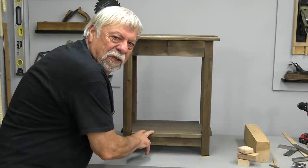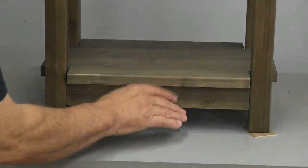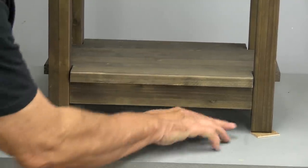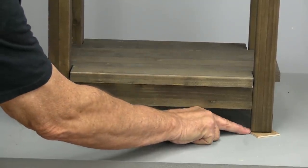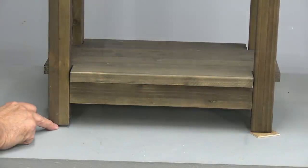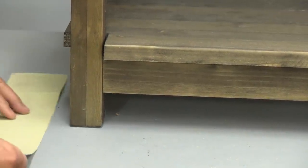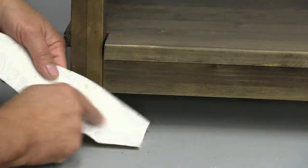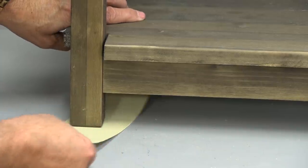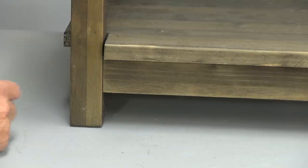Here's the little demonstration table I made a few videos ago. Let's talk about leg fixes for a moment. Often you'll get a table or a chair that has a wobble. I've put a piece of thin plywood under here to create that wobble so I can show you how to fix it. If you have a small amount of wobble, you can typically use cloth-backed sandpaper drawn underneath the leg that's long, and that will fix up the wobble.